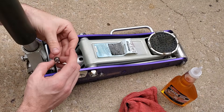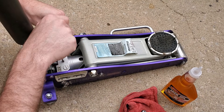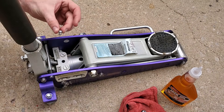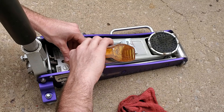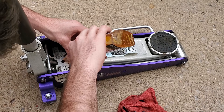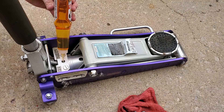Okay, so it's pumped now. Now we're going to fill it back up. To do that, we're going to place that screw aside, take this Phillips screw out — this is another place where it might leak, there's also an o-ring that goes around that one, so you might want to buy an o-ring for each one. Then we're just going to fill this up super slowly, one drop at a time, until it's all the way full.